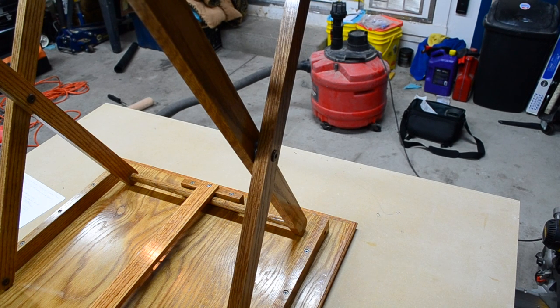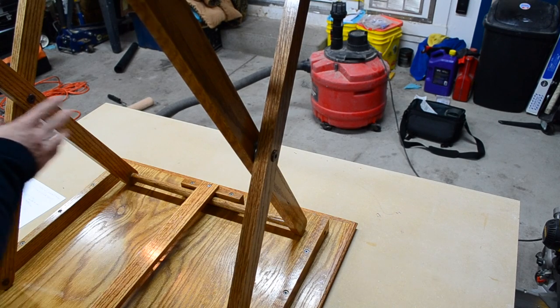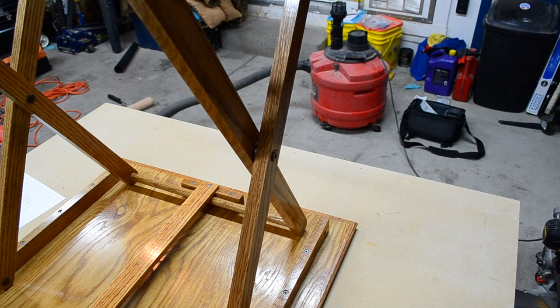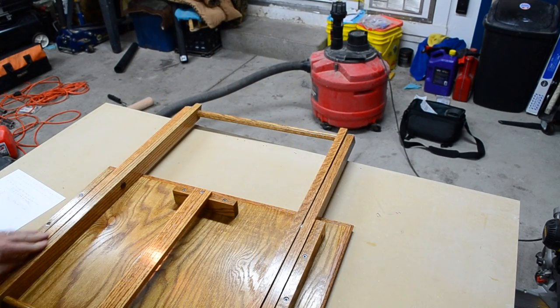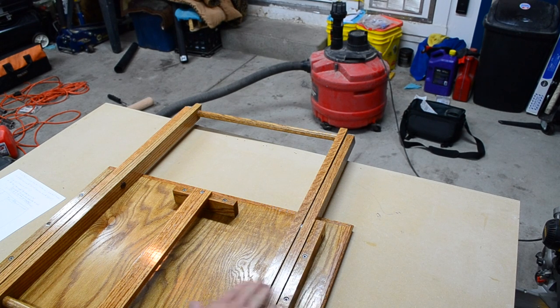One thing I noticed: if you're not cutting this wood fresh and you're buying it pre-cut at this width — which I did — typically from Home Depot the quality cuts aren't the best. These two legs and the two legs on the other side are actually different thicknesses as far as width. It's so minute you might not think it's an issue until you fold the tray flat, and then you'll see a sixteenth of an inch lip right there that isn't smooth. When you have multiple trays, that can cause an issue.